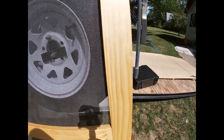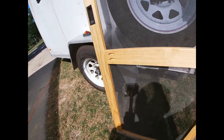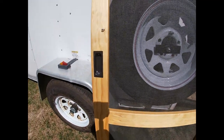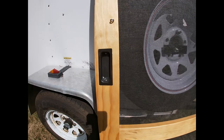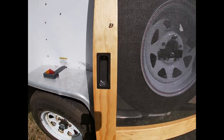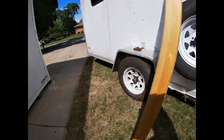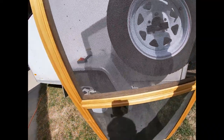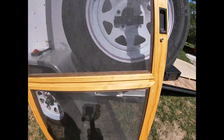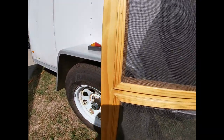You can take it and push hard on it — as you can see, me pushing on it and moving it around, it doesn't rack at all. I did cut little handholds in on either side. I just drilled out for the deepest part, which wound up going all the way through, and then used a hand chisel to cut out and inset the handle.